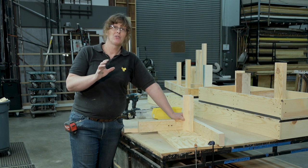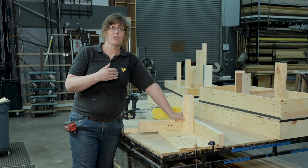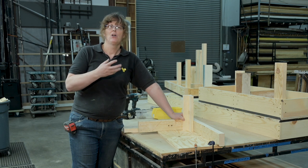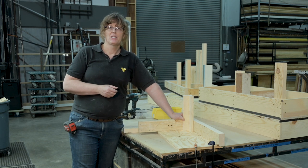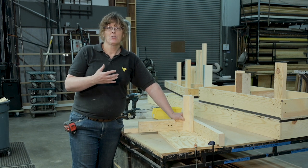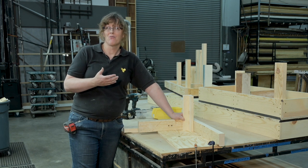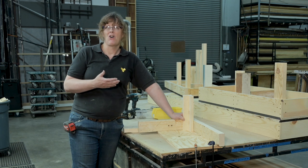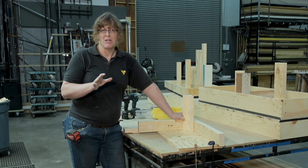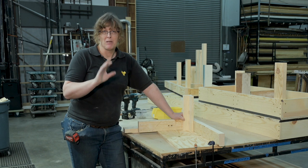So I'm really relying on that screw more than I should, especially when we're using drywall screws. Drywall screws are not designed to be under that constant shear force. We use enough of them so that it spreads the load amongst all of them — it's not just one drywall screw holding that whole joint. Now we use construction screws a lot more; they're a little bit stronger than drywall screws, although tests have shown that drywall screws are not really any more brittle than most varieties of construction screws. They're all going to break under the same kinds of stress loads to varying degrees depending on the screw type, head type, and shape.